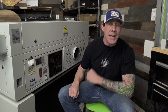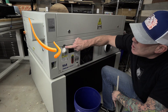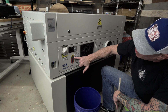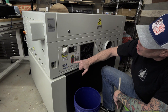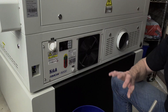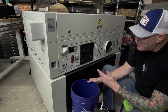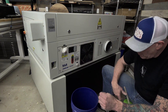Let's go over this chiller and show you how to get the water drained out of it — this is a very straightforward process. You have the water inlet cap right here. This is going to be your control panel with the red, green and yellow sticker that says alarm, normal, and full — that's your water level indicator. You want to make sure it's at minimum in the green, and preferably at full. Down here in the bottom right is your water outlet. You're going to need some type of waterproof vessel to catch the dirty water — we're just going to use a five gallon bucket placed right below the water outlet.